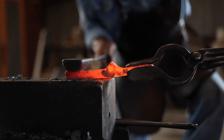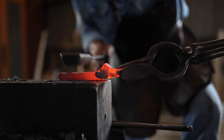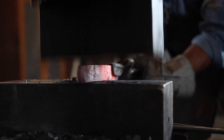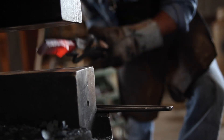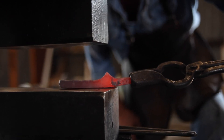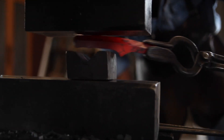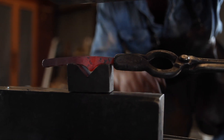I'm going to try to get these the same thickness, or at least close. Now we've got that — we've got a peak. I am going to trim that off a little bit, actually I'll probably just leave it, it doesn't need to be trimmed off. Now I can heat the piece up, get the bead block, set it in like that, and set a top tool on top of it and drive it down into that bead.